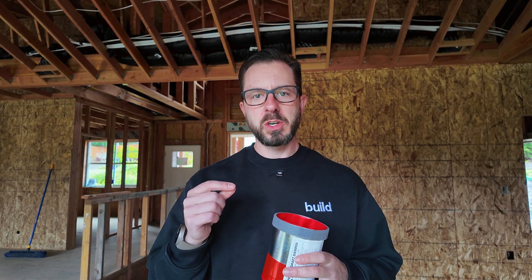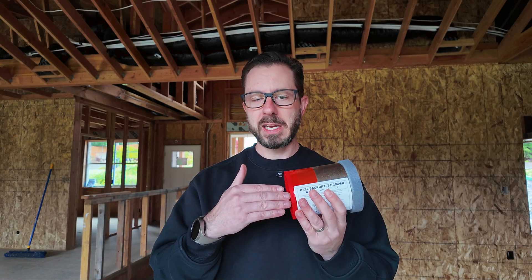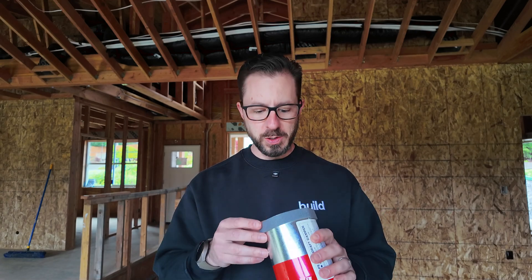We always have exhaust fans in each one of our bathrooms. Four inches is the size of the duct. When we do a blower door test, we negatively pressurize the house. This should help to give us a better blower door number, but it should also help that when the house is in service, we don't have air coming from the outside back in. Now, if you're doing a passive house home, you actually do a positive and a negative blower door test, and then you average those two.